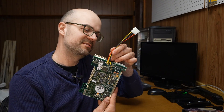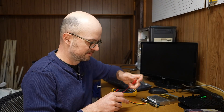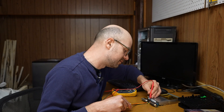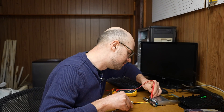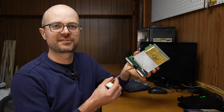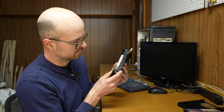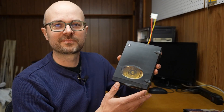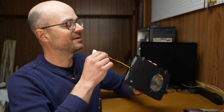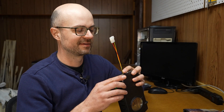That ought to do it. I'm checking continuity between the pins I soldered and the expected pins on the power connector — ground checks out, five volt pin checks out, and the 12 volt pin checks out. All looks good. I'm pretty confident this should work, so I'm reassembling it. I had to cut away a little bit of the plastic to let this pigtail pass through, but it looks pretty good. If this works, I'll be able to use a PC power supply — or if I ever find the original power adapter, I'll be able to use that too.